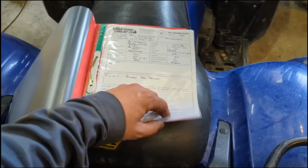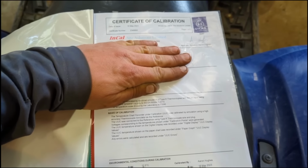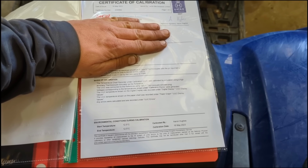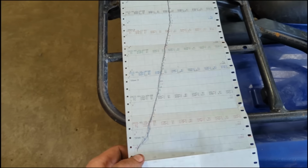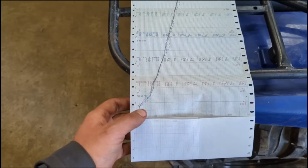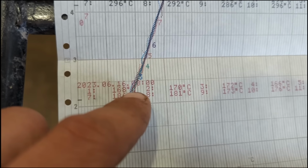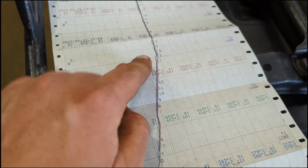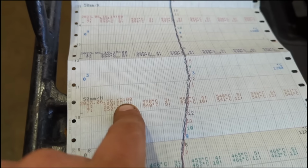So pretty cool, just got the report from the heat treatment guys, and a calibration certificate showing the calibration has been performed for the heat treating measuring equipment. So we've got the actual temperature graph from the point that it was switched on. We can see that by 8 a.m. we were at 170 degrees. This climbs and climbs and climbs until it reaches its peak, shortly after 12 midday,